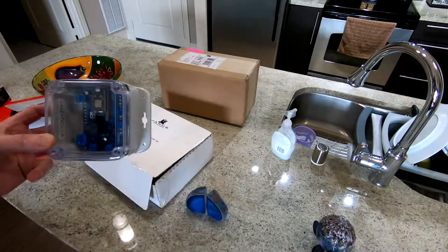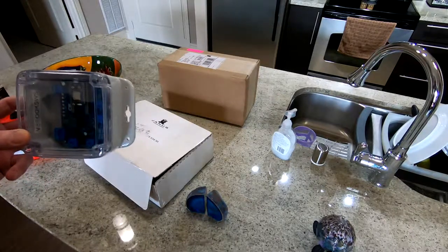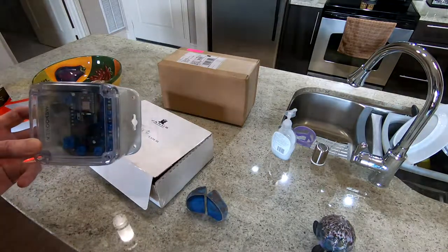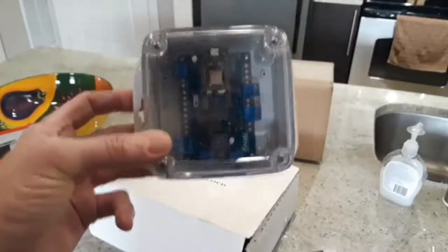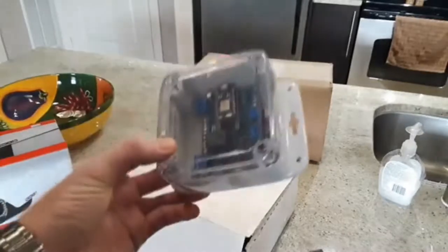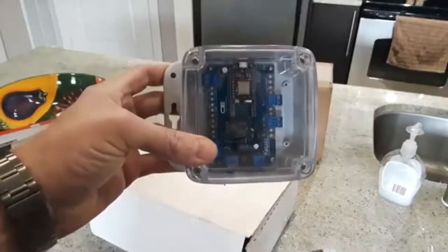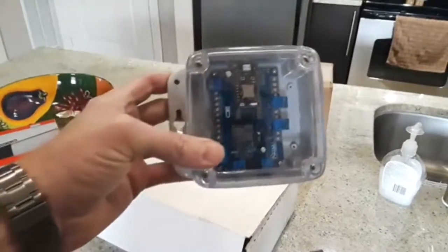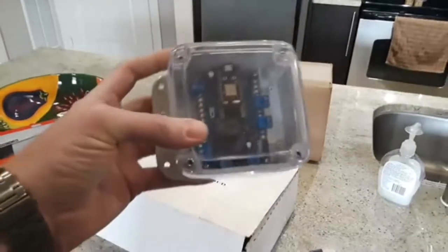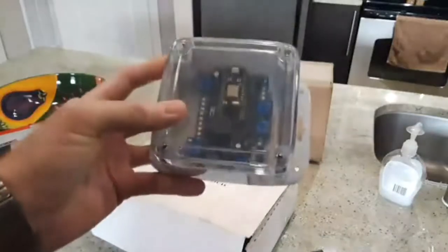Because you're on the wireless network, you're not limited by range. There are a lot of products out there promoting a wireless bridge that will give you a mile or two miles of range. But with a Wi-Fi bridge like this, you have the ability to be basically limitless — wherever there's a network and wireless infrastructure, you can be anywhere in the world. You can actually have one access control panel at one apartment complex and control 15 different doors anywhere in the world without having to put access panels everywhere. The downside is you have to make sure your infrastructure is stable — if you're using cheap wire, a cheap router, and not doing battery backup, then you've got a concern.